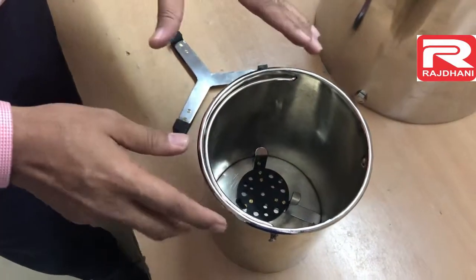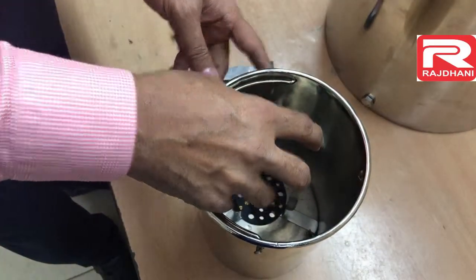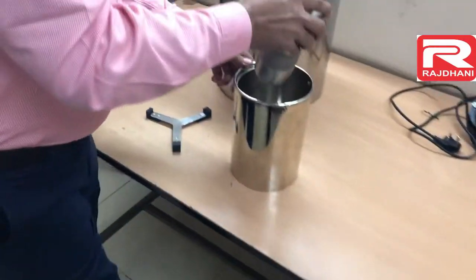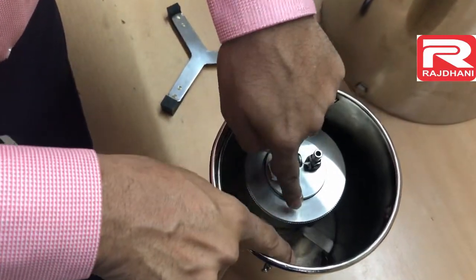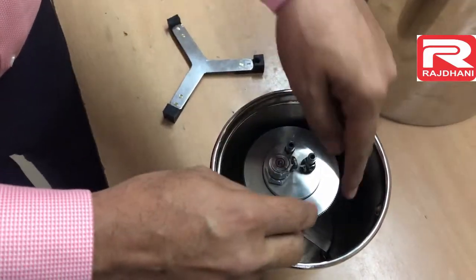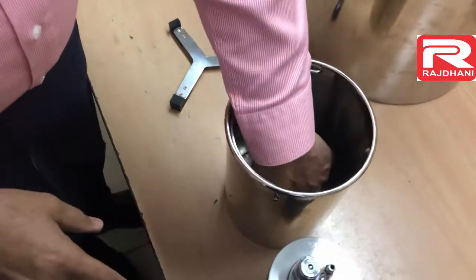Why are we doing this? The main purpose is that this space is limited — it is six inches in diameter. If I keep the bomb in the center then the space around it will be less. So this bomb is kept off-center. By keeping the bomb this way you can see there is more space on one side. We use this extra space because we have to keep the sensor and also the stirrer propeller in this space. If the bomb is in the center it is very difficult to accommodate the stirrer propeller and sensor.